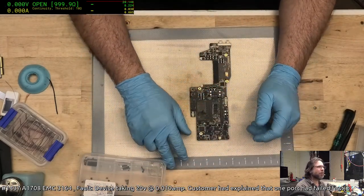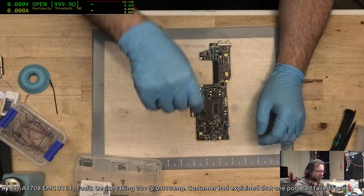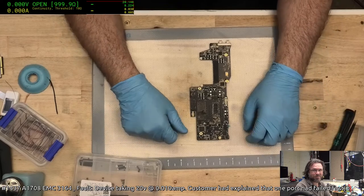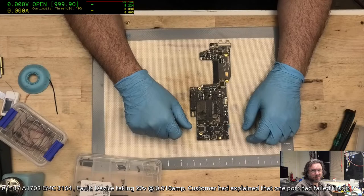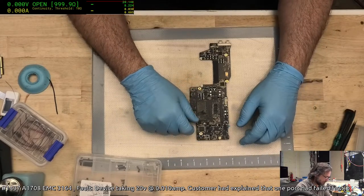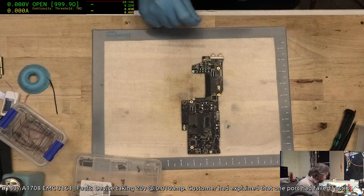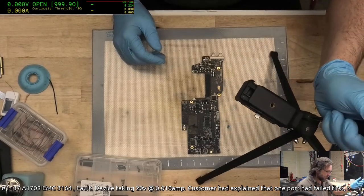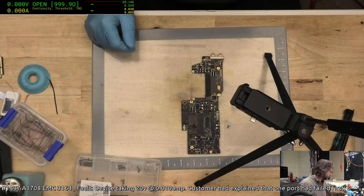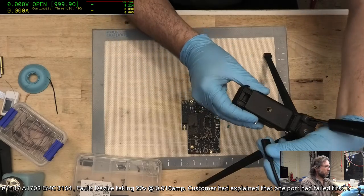Yeah, not enough current for the infrared, unfortunately. Not enough power, rather. So, 20 milliamps at 20 volts, what's that, 400 milliwatts? You know, it could show up. Well, can't hurt. It might show up, but I don't know how well it will show up amongst the noise. At least we haven't used any really hot stuff tonight, so the bench itself should be pretty quiet, as it were.